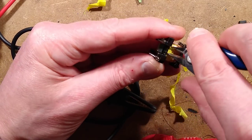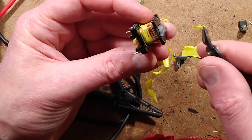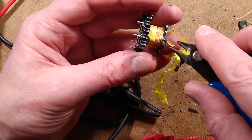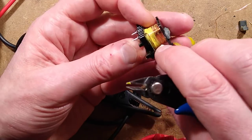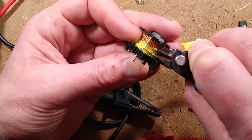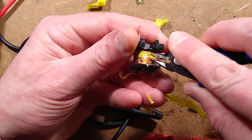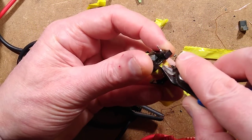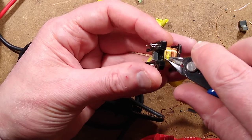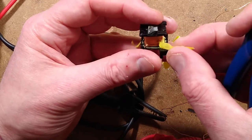It just... You think, even if it passes, it's a 3,000 volt test. What about time? Because these things can run quite hot, these little transformers, and vibration and time could actually, you know, break down the insulation in these. I just don't like modern supplies versus the old traditional ones. The old ones actually made a huge effort to keep the 240 volt side in the UK away from the low voltage, the 5, 12 or 24 volt side.